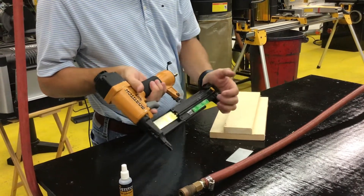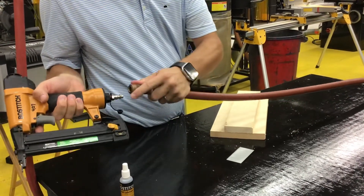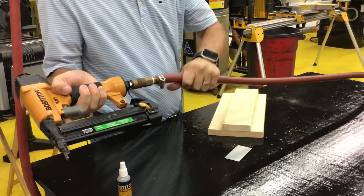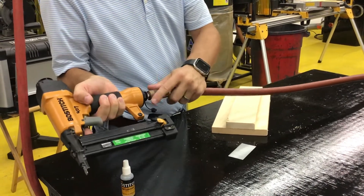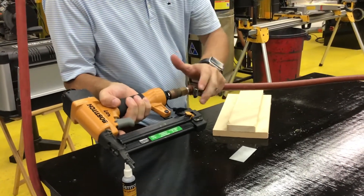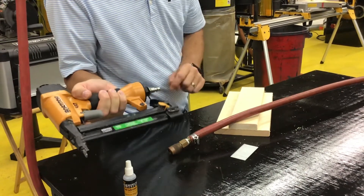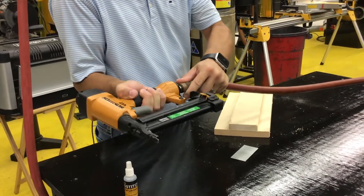So, putting the staples back in, then you hook up your air hose. I'm going to slide this back and push this on — you have to push very hard — then you release that and it stays on. A lot of times you see people who cannot get this to stay on. Now to release it, you want to push this towards the hose, pushing the hose towards the actual nail gun, and you will slide that back and release. That releases the air that was built up inside of it — that's what that noise was. Slide this back and then slide the gun on.